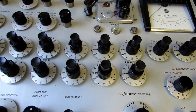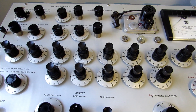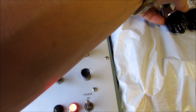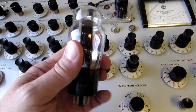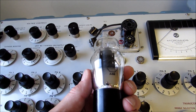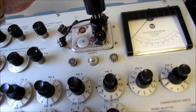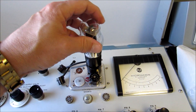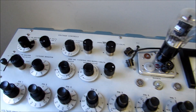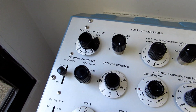The tests on this are extremely repeatable because of the different adjustments that we have, and the tests have an accuracy of within 1%. We're going to be testing a couple of antique tubes. These are both 6F6G octal base tubes, and we're going to do a very simple measurement for transconductance. We've already done the setup of the tester, but I'll go through it very quickly and show you what we do once we've plugged the tube in.